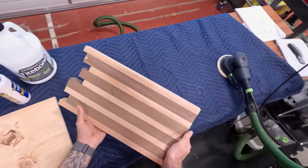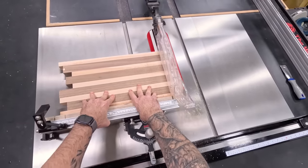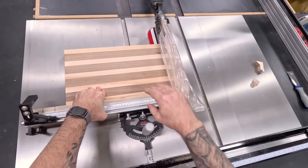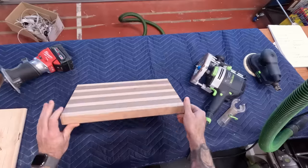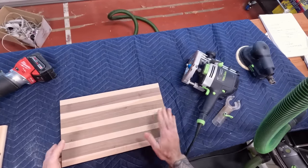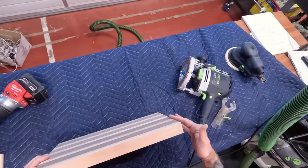Let's go make a couple of cuts. I'm just going to use the miter gauge to make this cut at the table saw — this side is just a cleanup cut, straightening it out. When it comes to edge treatments, you've really got a ton of options: you can keep it kind of blocky, just give yourself a nice round over, make it really decorative with bevels, or do a juice groove. I'm not going to get too fancy — I'm just going to do a chamfer on the underside, which gives it a little natural lift, and then maybe just a little round over on the top.